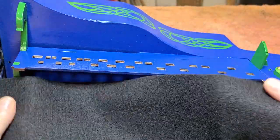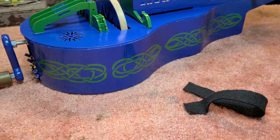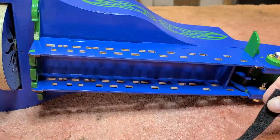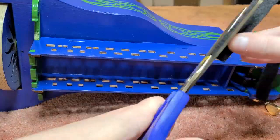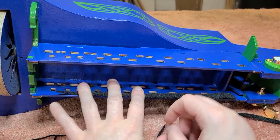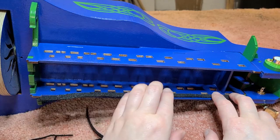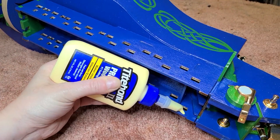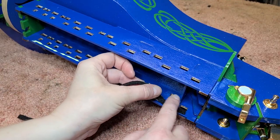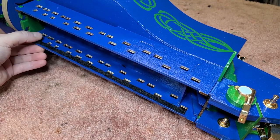I'm using this black acrylic felt to cut out a strip that is slightly thicker than what I need, and then trim it down until it fits. I could measure everything out and make a pattern, but this way is simpler and a little less time consuming. Here we are all trimmed up — it's slightly longer than I need, so I'll just clip off the extra and then glue it down. Since this strip just needs to stay in place and won't have much stress on it, I feel confident gluing it straight to the finish. If you want to be extra sure it will stay in place, you can sand where the strip will go to add a little tooth for the glue to grab onto.